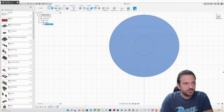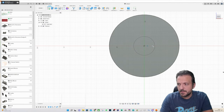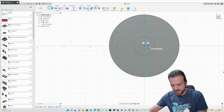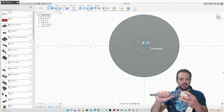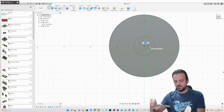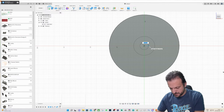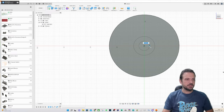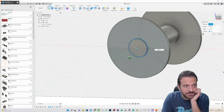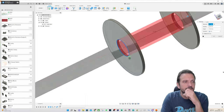We also need a hole through these things, so let's punch a hole through it. I've got three reels to measure — this one is about 21.5mm, this one is 20mm, this one is 20mm. I think 20mm is probably right — you want to go the smaller one because that's your worst case scenario. On this axis you definitely don't want to be generous.